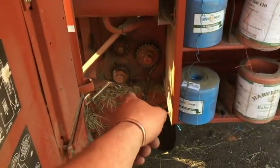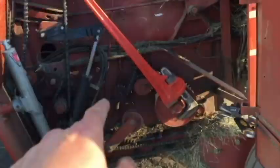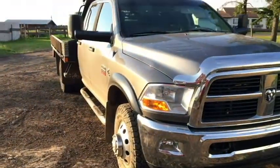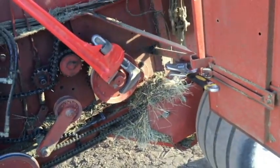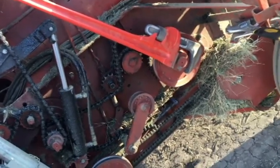Here's what I half-figured out: take the chain off the twine side, take the chain off the driver side — this chain that drives the sprocket and a drive belt. Jump in the truck, drive to town which is 20 minutes away, and get one big honking 48-inch pipe wrench. Then you just start heaving on it and eventually something's got to give. It started spitting that double-fold belt out, so I'm going to keep turning and pulling until I get these belts out of here.